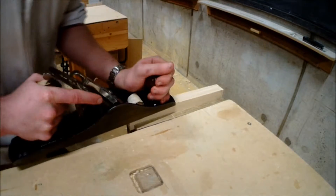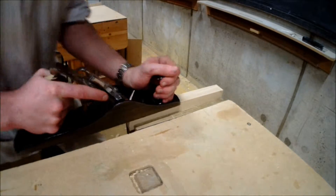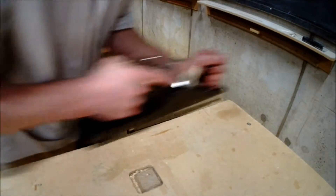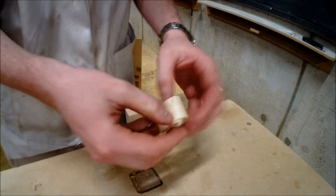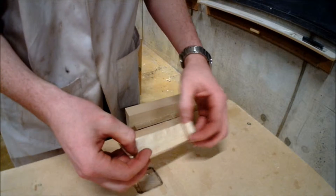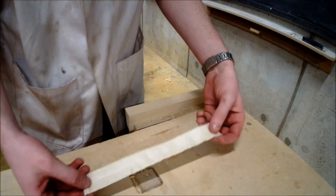As you can see my wrist, elbow, and shoulder are all in one line. After planing, a shaving from the piece of material is provided. This shows if you are taking off equal material all the way across the piece as shown in the video.